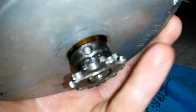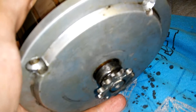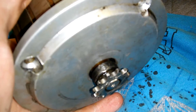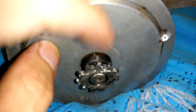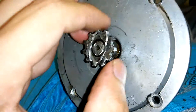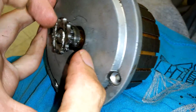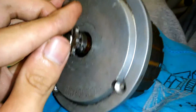Here's the motor and this is the little dowel pin down there — you can see both ends. We put a bolt through there instead of a dowel pin since we don't have any. I'm going to see if I can take some JB Weld and just cover up both sides of the shaft where the gear meets. This slips on and then the bolt goes through and holds the gear from spinning, like you guys would have seen earlier in the previous video.